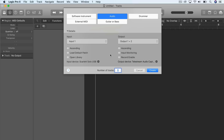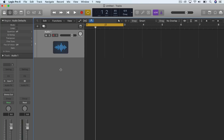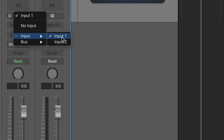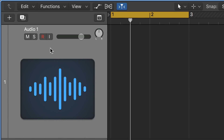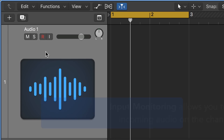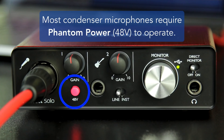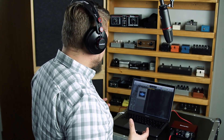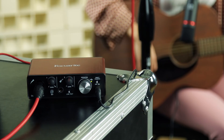Next, let's set up our microphone. In Logic, I'll create a mono audio track — it's only one channel — and make sure the input on the track is set to Input 1. Our audio interface has two channels: Input 1 is the mic input and Input 2 is the instrument input. I'll click the I button to input monitor the track. Condenser microphones require phantom power — a 48-volt signal that runs up the microphone cable and powers the capsule inside the mic — so I'll turn that on, pull up the mic preamp gain a bit, and then enable input monitoring. You can hear my voice through the DAW, and I'm hearing myself in the headphones as well.